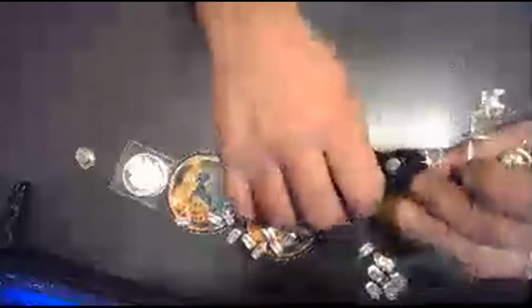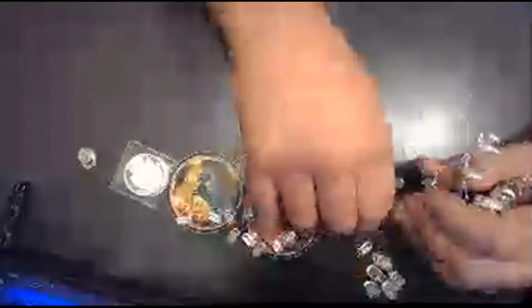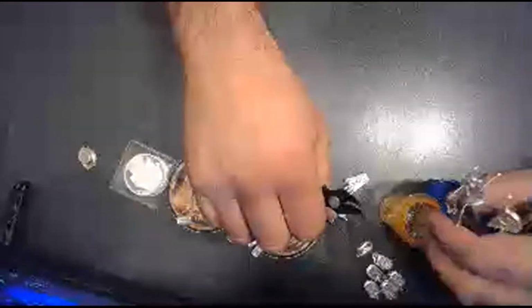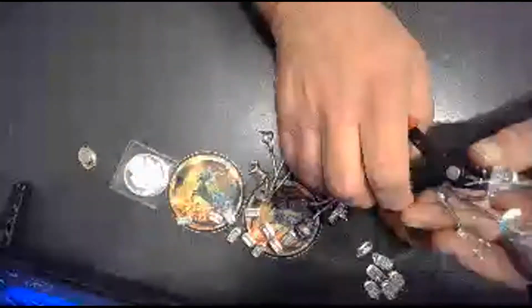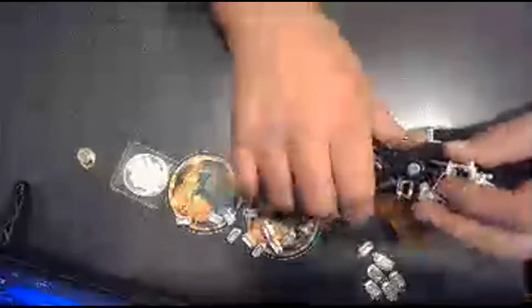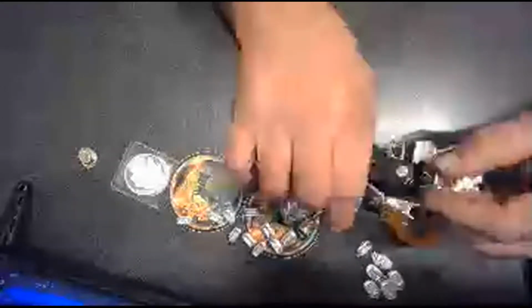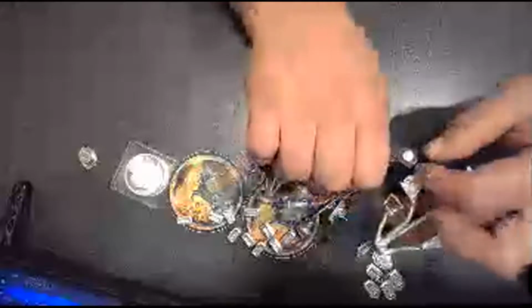If you're getting pressure, then it's going to cause you problems. That air is trying to come out of your mold while your silver is going in. So, I mean, I think they help, but I'm no big veteran at this. I've only been doing this for a little bit, so I am by no means an expert on it. But it seems to me if something's going in, air's coming out. And air's got to come out. If it's got to come out through the same passage that your silver's going in, it's going to cause some problems somewhere.